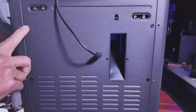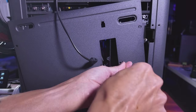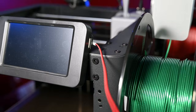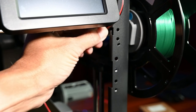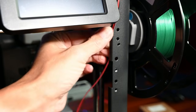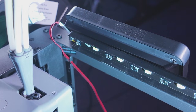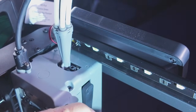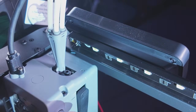Remove the IFS wire followed by the rear cover. In order to remove the rear cover, there are six screws along the perimeter and two screws next to the poop chute that will need to be removed. Route the power cable for the light bar over the top frame bar towards the front of the printer, and then secure it in the small notch on the right front vertical frame. You may be tempted to route the cable from the backside instead of around the front, but there's a reason they don't tell you to do this — the cable will get pinched by the tool head when it moves fully forward.